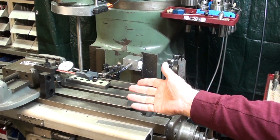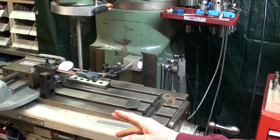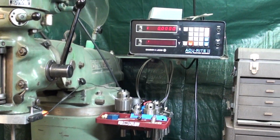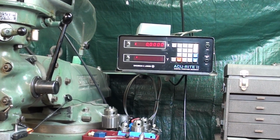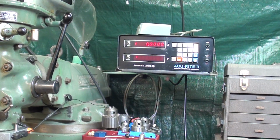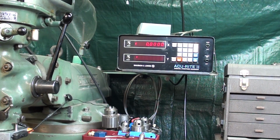I enjoyed doing that, and I hope you enjoyed watching it. Now I'm going to approach this just a little bit different as I conclude this video. And in some ways, just the opposite. That is, I'm going to use the digital readout here as the standard. Now, you won't see me doing it, but I'm going to crank, and I'm going to be watching this, and I'm going to move it exactly 2 inches, 2.000, on the DRO, and then we'll go back and look at the other 3 readings.